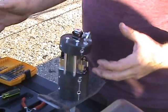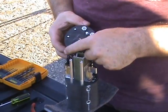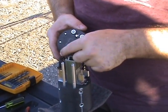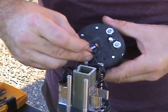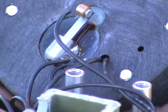So we pulled out the apogee detector and decided to test it before flying again. We found that there's a wire that broke. This is a double-throw switch — whatever. The wire broke off right where it goes into the epoxy, where it's soldered on the other side of the switch. It broke off in kind of the one place where we can't get at it to fix it.